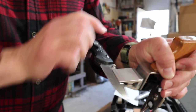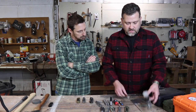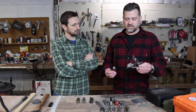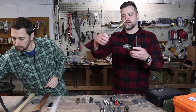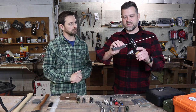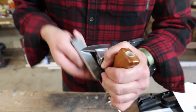What I like to use — and there are a lot of these on the market from different companies — is a guided diamond system. This happens to be a KME brand, the one I like to use. I use it a little differently than most people, but you set your angle there, which gives you the angle you want your blade sharpened at. Then you put these diamond-based stones in here, lock your blade in, and draw this along the blade sharpening it. This is going to cut into the blade and do a really good job sharpening it.